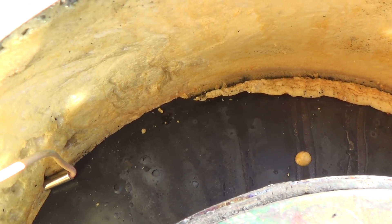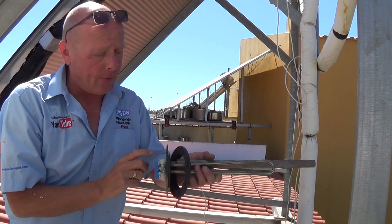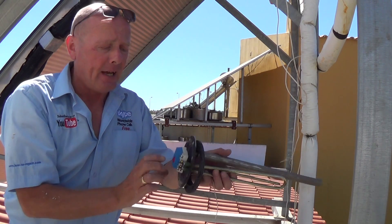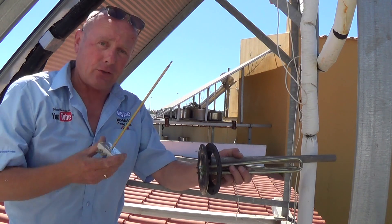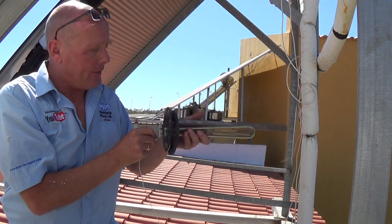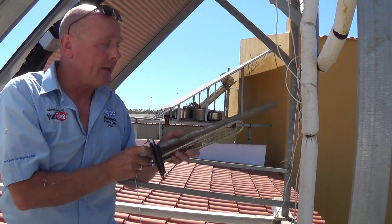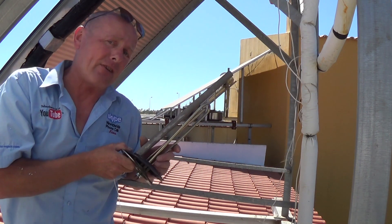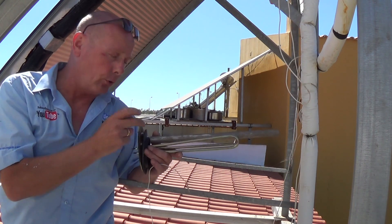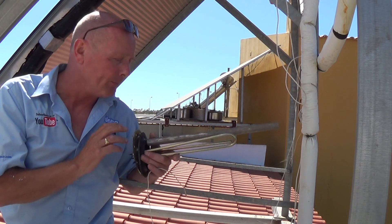On a normal electrical system you have a heating element for winter emergencies and an anode. If the heating system isn't inserted, the thermostat can come out and you can see the depth of the probe — the lead with the sensor can be threaded up into the middle of the tank for a very accurate reading. But if you have a heating system fitted, many don't have additional probe tubes, so you need to make a small hole in the insulation and tuck the probe as close to the tank as possible.